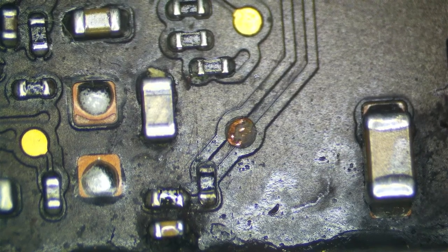So the guy upstairs not doing its job would be like, let's say we're missing 2V7 NAND because the Piccolo PMIC is bad. An open line would be like a broken probe point where the line is open, it's broken, electrons cannot flow through. Or a short circuit would be something like a capacitor that's shorted to ground and pulling that voltage right to ground. So no, a probe point would be something totally different.